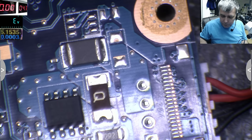And from here, it's going somewhere, I suppose here. Yes. So look at the multimeter, zero. Yeah. So you just found the first MOSFET. But if you check, every pin will be zero because these are all soldered together. Okay? All are soldered together. Yeah?